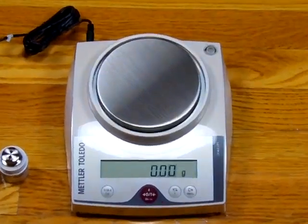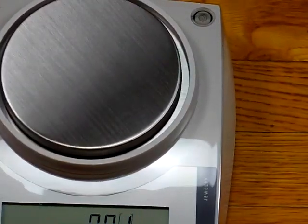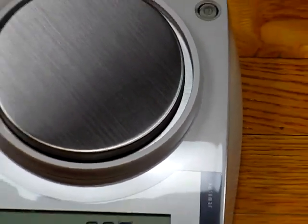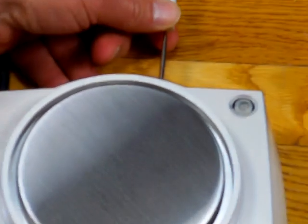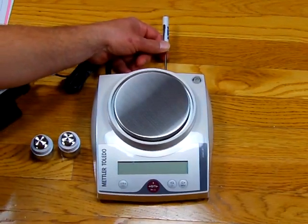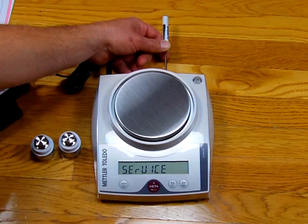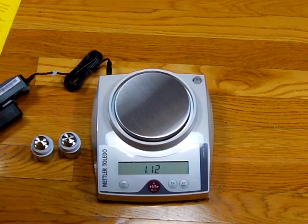We're going to the back of the service port. First we shut off the balance. We have a little screwdriver that we'll use to press that button in the rear — we need to hold that button in place and we'll see 'SERVICE' come up on the LCD display. And there it is — the service mode is showing along with the software revision.